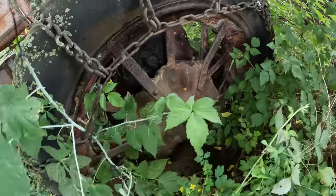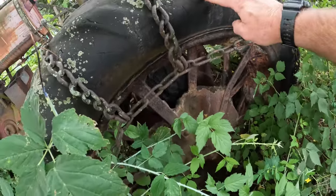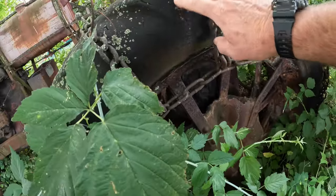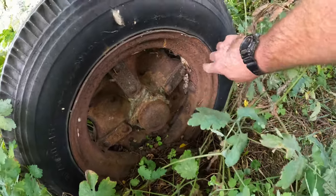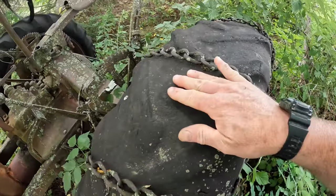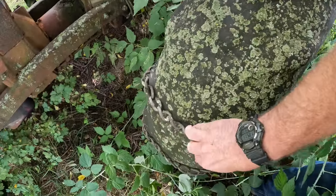Underneath these berry bushes are cut-off steel wheels, and what that means is this tractor originally came with a steel wheel — no rubber — and later on it got retrofitted with this rim here. They just cut the steel wheel off, left the spokes and the hub on, and welded this rim on so that they could put a rubber tire on it. Same with the little front tires — these were originally steel wheels and they welded on a rim for a rubber tire. I can imagine the farmer who did it was awfully happy with the ride versus the old lugged steel wheels. Here's a farmer fix — this tire has no tread left on it, that tire's got quite a bit. I imagine over the years they were salvaged from other tractors, and to make up for the lack of tread, they put a set of chains on it. Cheaper than buying a new tire.